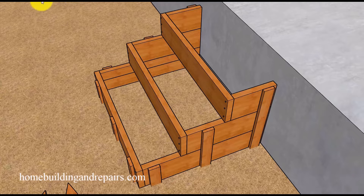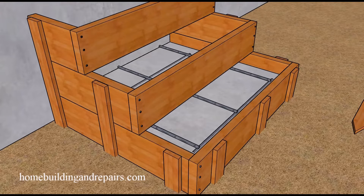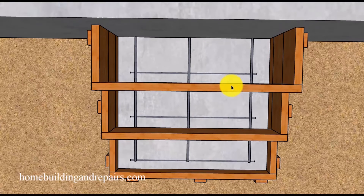For those who do want to install rebar, here's an easy way to do it. The first step is to pour a section of concrete about halfway up on the first step — if our step is seven and a half inches, maybe three to four inches. Then simply lay the rebar on top, so you won't have to hang it with wires. The rebar needs to be a minimum of two inches away from the sides and at least three inches away from the soil.